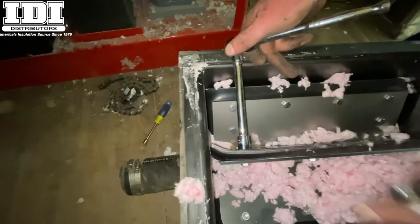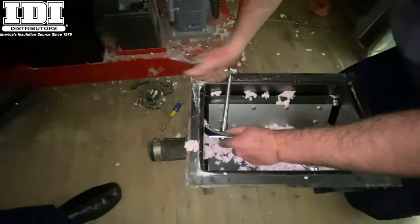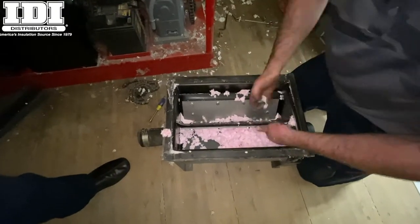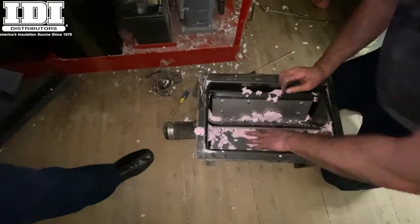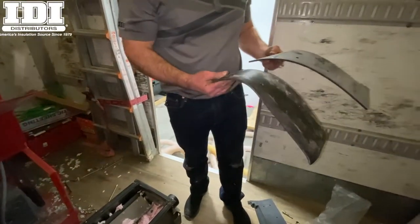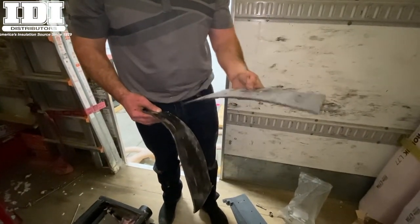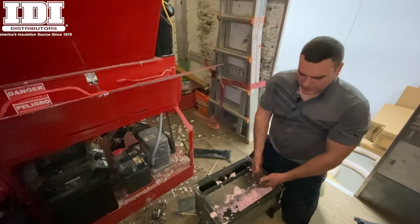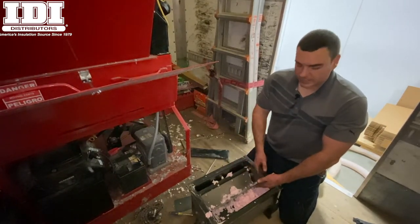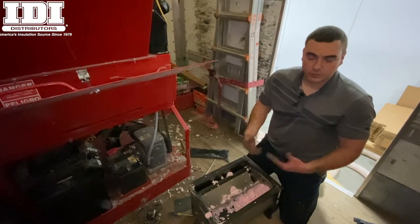Now we're down to the seal. We're going to take our half-inch socket and half-inch wrench and loosen these up — there are six bolts on each seal. You can see the difference in stiffness from the old seal compared to the new one; you're going to get a much sturdier seal and a lot more air pressure. After removing a seal, you could install the new one right away, but if you do that every time you rotate it, it gets harder and harder to rotate the airlock. I take out all the seals first, then start putting the new ones in — it just makes it a lot easier on yourself.